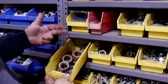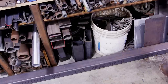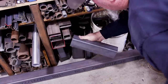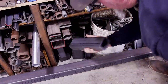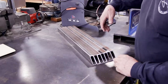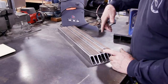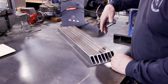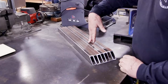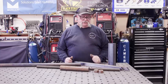We're also going to need a couple of inch and eighth nuts — I've got inch and a quarter, inch and eighth, inch seven eighths, a various bunch here. There's a couple of inch and eighths, that'll work. I'm also going to need a piece of this two inch by three inch rectangular tube with a three-sixteenths wall thickness — we're going to use a section of this for the top piece. And finally for the legs I have this three quarter by inch and a half rectangular tube left over from a previous project. I've already got a 45-degree cut on one side, so we'll just trim it up to the right length.